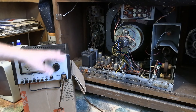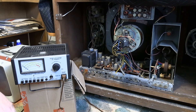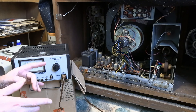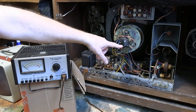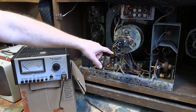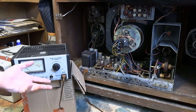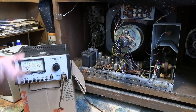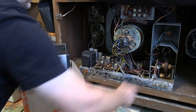In general it looks like this set saw more use — the tubes are a bit more discolored. I think it's just slightly older. And just like the GE, this one seems to have been tinkered with a little bit. When we took the cover off in the first video on this set, we discovered the high voltage cover was off — it was lying to the side. I suspect somebody went in here and tried poking around, though they may have had the cover off for ventilation too. These flybacks tend to run hot, and you can see the wax dripped down.